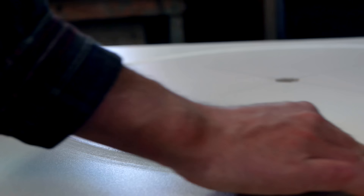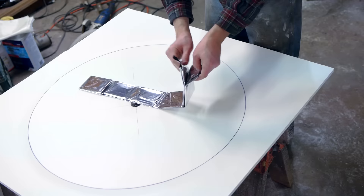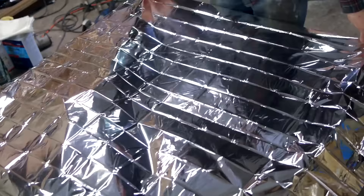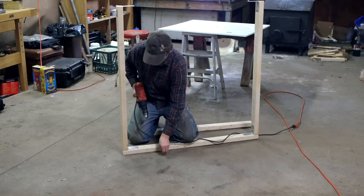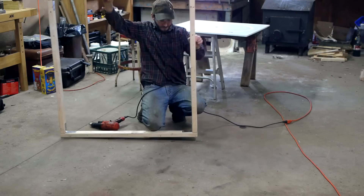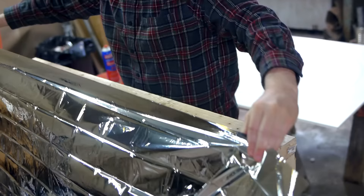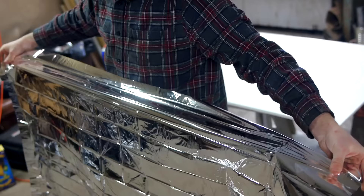It's now time to take a look at the mylar sheets. Aluminized mylar is sold as space blankets, and they come folded up into a tiny package. Before this material can be used to make a mirror, it first needs to have as many of the wrinkles taken out of it as possible. A simple wood frame in the shape of a square and just larger in diameter than my PVC plate should work nicely to stretch out the mylar. The easiest way I found to temporarily bond the plastic sheet with the wood was with a coat of spray adhesive.